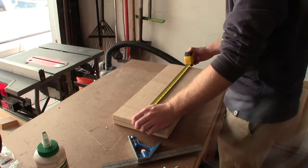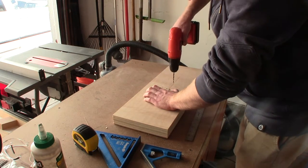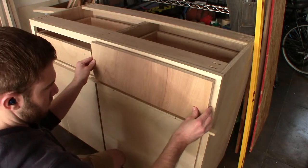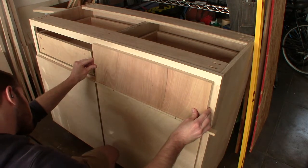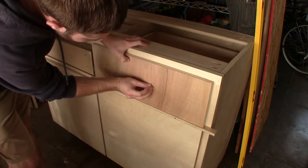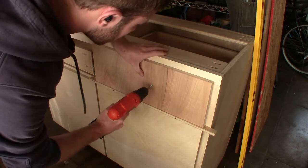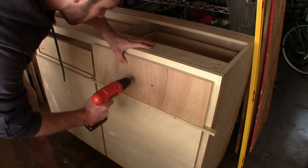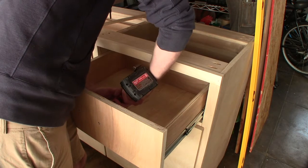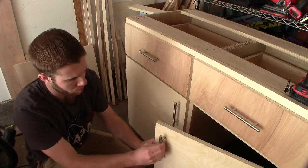Finishing up the drawers, all I had left to do was mount the drawer faces and apply the hardware to the drawer fronts. Using a trick many woodworkers use, I first added a spacer between the top of the cabinet door and the drawer front to make sure my spacing was correct. Then, using the holes I had previously drilled for the drawer pull, I attached the face to the drawer using some screws from behind — a lot easier than using tape or some other method. Then I removed the screws and attached the drawer handle. I also attached the cabinet door handles at this time.